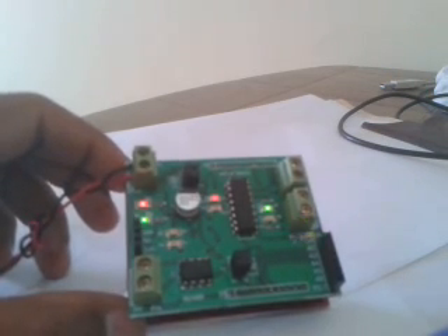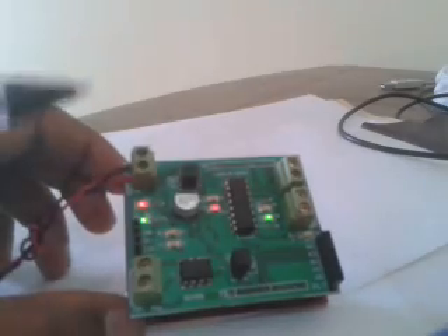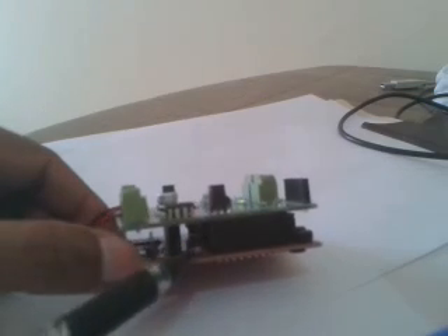On providing the power supply, you can see that the 5V LED is glowing and the 3V LED is also glowing, which means power is available for the 5V section — the L293D and MAX485 chip. The 3V supply created by the voltage regulator is also provided to the Launchpad board.